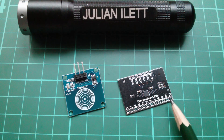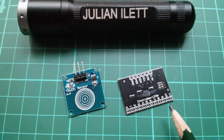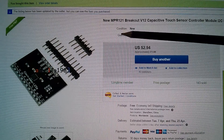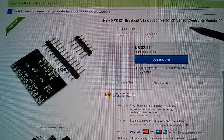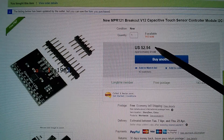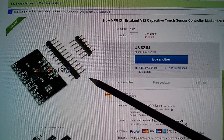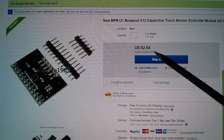While thinking of things I could do with this, it occurred to me I could make a little musical instrument, because there are 12 semitones in an octave. So if I couple these 12 inputs up to 12 little metal discs — I'm kind of thinking coins — I could make a little musical instrument where you press one of these inputs and produce a tone. The MPR121 breakout V12 capacitive touch sensor controller module I2C: $2.94, £1.98 — pretty good value for a 12-input touch sensor. That's about £2 per octave, so if I'm going to make a little mini organ with three or four octaves, that's not too expensive.